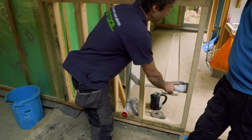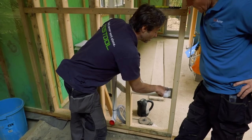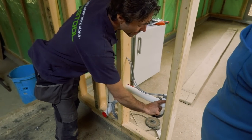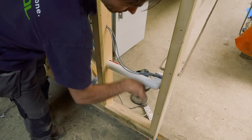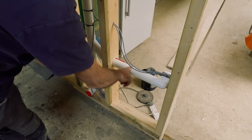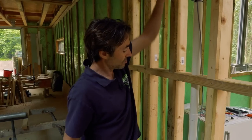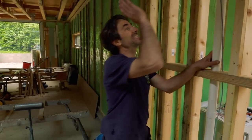This was something I picked up on YouTube from an Australian guy. The only knuckle bend you have is straight out of the unit - the idea being anything big that gets stuck there can't pass anywhere else and you can get it back out. These are generally designed to go up or down, but this Australian guy said you always want to put in a horizontal trap, because sometimes you've been vacuuming, you come to the unit, turn it off, and within a couple of seconds whatever's gone in is going to fall back down. Trust an Australian to think of that - they are the other way up, after all.